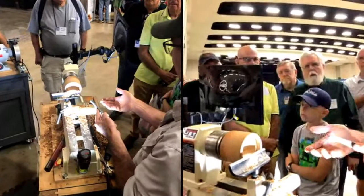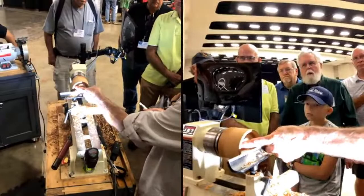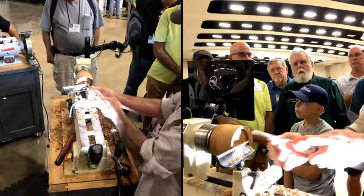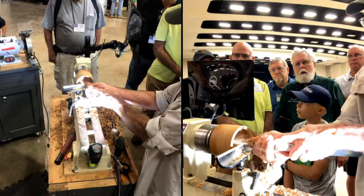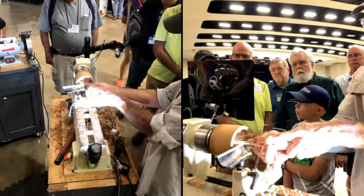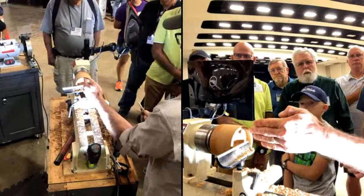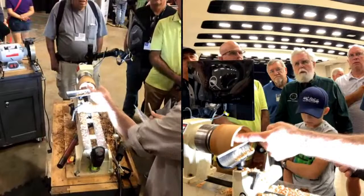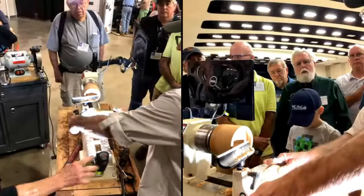One other thing I've got to point out to you, I put a stop back in there. I'll cut that again just to show you. This is an area where the thread is going to run out, because I can't let it run into the back of the interior of the box. So there's a line here, then it has a big groove way behind the line, so I can run that chaser over that surface without hitting the interior. Every thread typically would have something associated with that stop.